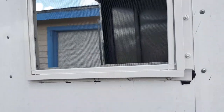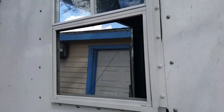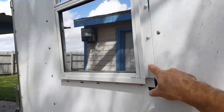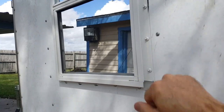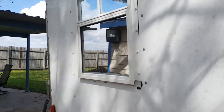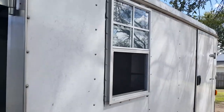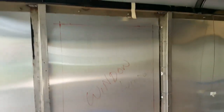When you position the window you need to be aware of that extra size. For screws — I think I got these for a carport or something — they're self-tapping screws for working with metal. They all have a rubber grommet on them and they happen to be already painted white, which is a good match. I'll probably have to get some more to finish the installation with the other two windows. On to cutting holes.